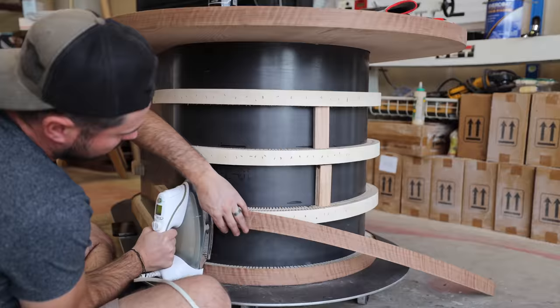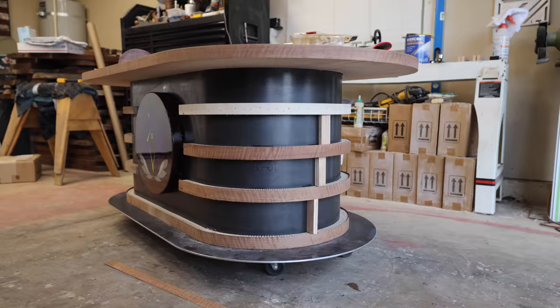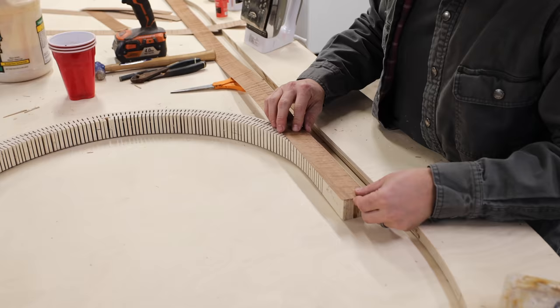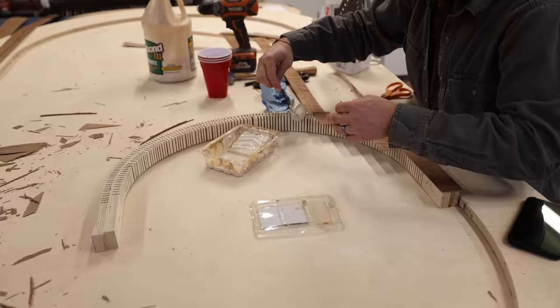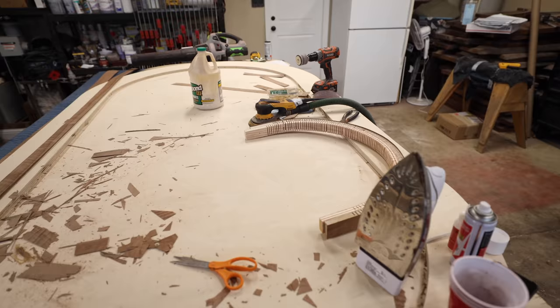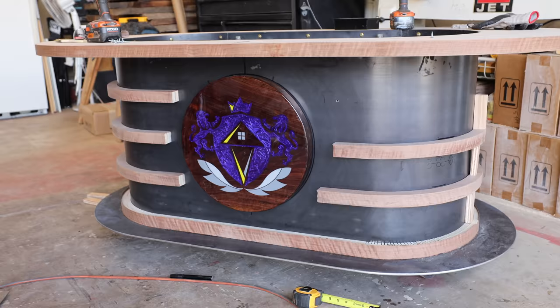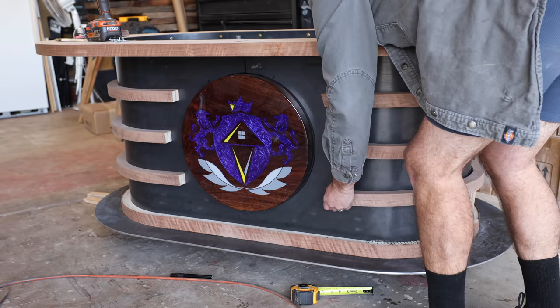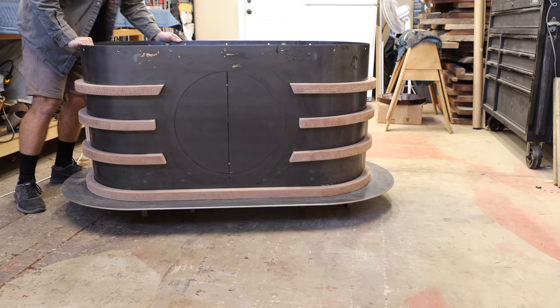The bumper fits great — I left enough room for the upholstery and foam to fit up underneath, and now I'm moving on to the rings. I did another bazillion curve cuts, did a two-stack of birch plywood, and started the ironing process with all the veneer. Each ring I used one piece of veneer and alternated the grain on each piece I was gluing down so it looked continuous all the way around. This part was definitely painstaking — tons of time and tedious work to get these all lined up correctly, sanded, and looking seamless. I pre-mounted all the rings, then took them off one by one to make the angle cuts on the top two and the bottom two, making the angle a little more steep to account for the circular logo.